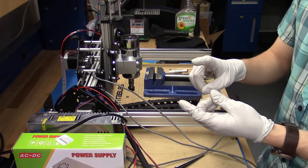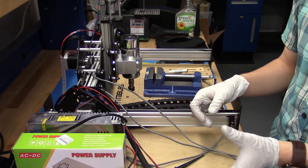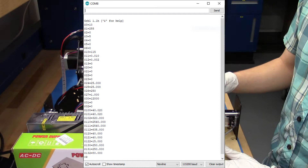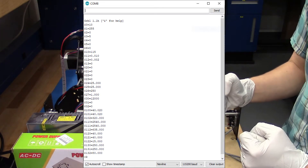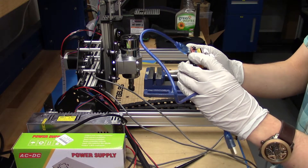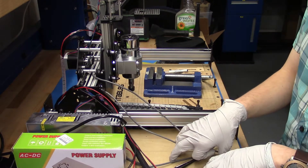The other things were the acceleration as well as the max velocity. I wanted this to get up to speed fast, so I put the X and Y acceleration pretty high. I only increased my Z-acceleration by about five — I think it's millimeters per second squared. On screen I'll put a snippet of the settings I use for GRBL version 1.1. This is also an update from 0.9 to 1.1, and I couldn't really find anything on how to properly do that, so I've been toying around and finally found something. The new controller with the Arduino and cable was 20 bucks — very highly recommended. I also just 3D printed out some cable track, and ultimately I'm going to use it to clean up the CNC and attach the new power supplies.